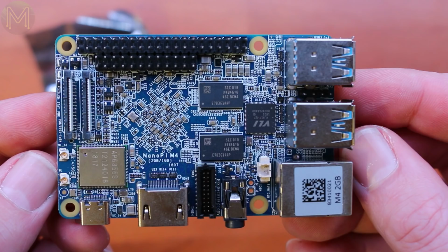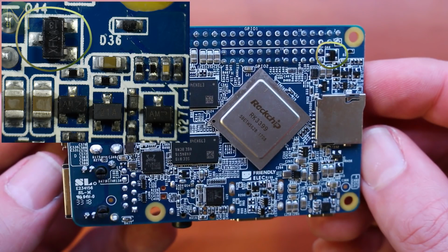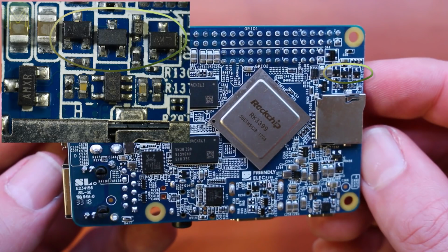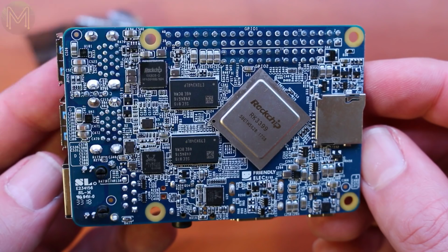There's not a heck of a lot of action on the top side. However, on the flip side we have Q44, yeah, another MOSFET, and even more of the little buggers. U94 is a 2-channel logic level converter from TI that I am using on my Works UPS boards. This provides translation from the SOC's 1.8 volts to 3.3 volts on their GPIO header for I2C.